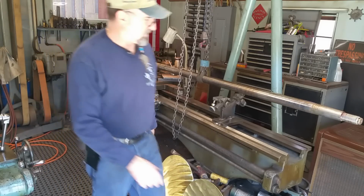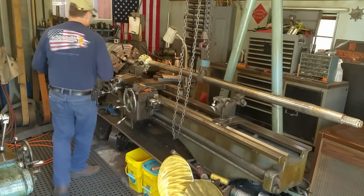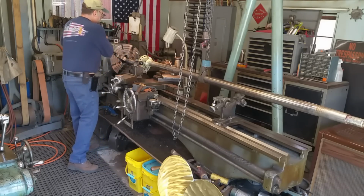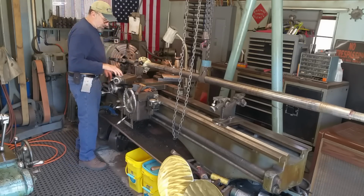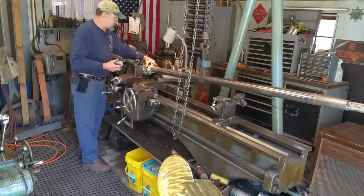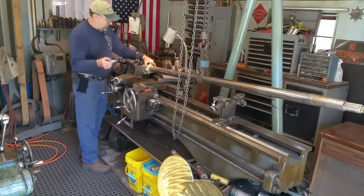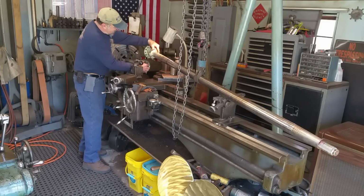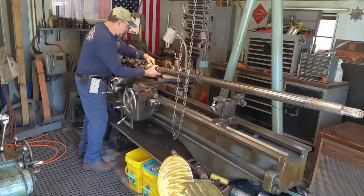Alright, I want to look, make sure taper's all completely out in front of there. Let's just go ahead and we're going to give it like an extra inch right there. Alright, we're going to tighten that down. Tighten this one down here. Now, these have 3-inch female registers. Each one's just a little bit less than a 1/4 inch now, because I think they start out at a 1/4 inch. I cut a wafer about 400 thousandths thick, and I'm just sticking that in here so that it'll match halfway with this one and halfway with this one.